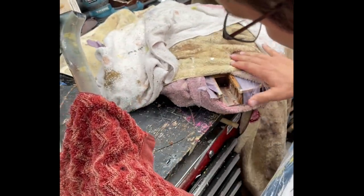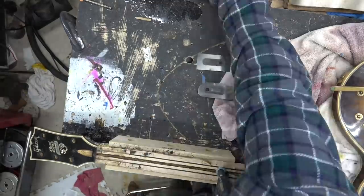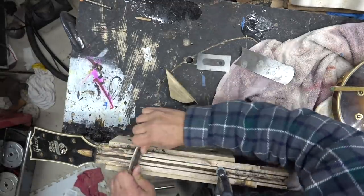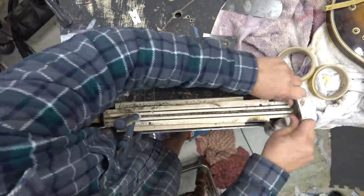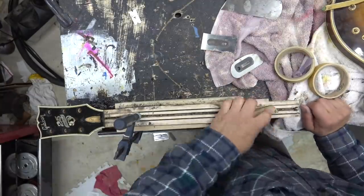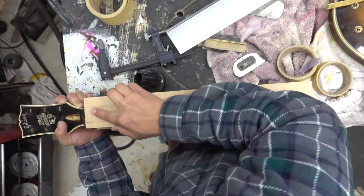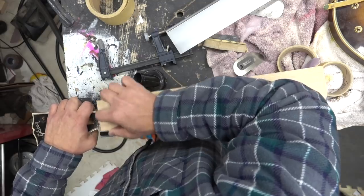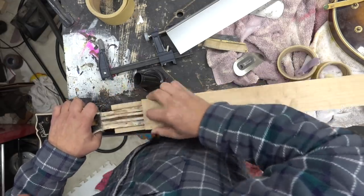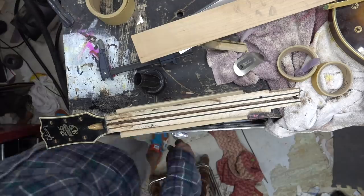You can see the finish is all hazy — that's from all the moisture getting kicked around. All that dries out at the end anyway. We're going to clean off the fretboard with a couple of scrapers. I love the StewMac thick scraper — those work really, really well. We'll pull off all that glue. When I let this glue dry hard it really was a pain to get off. Then I use a straight edge to make sure I've got a couple of safe spots that are straight — the upper piece by the nut and the back heel of the neck where the tenon is. I need to know what I've got to work with before we start doing the patch.